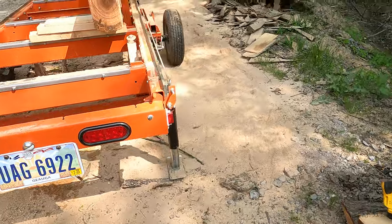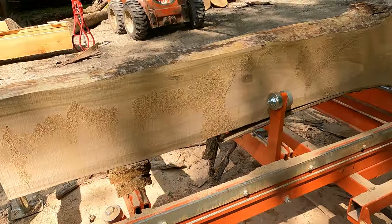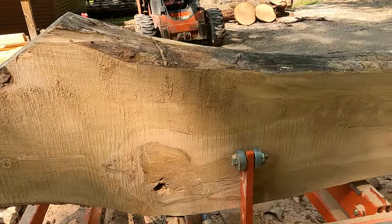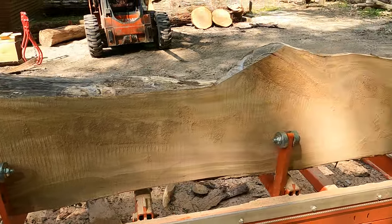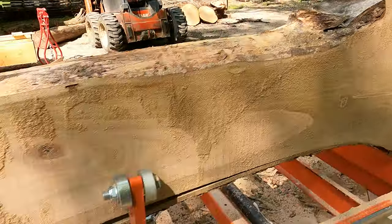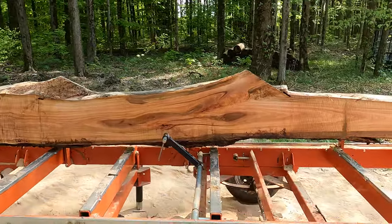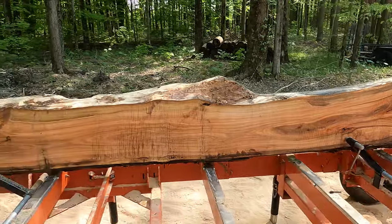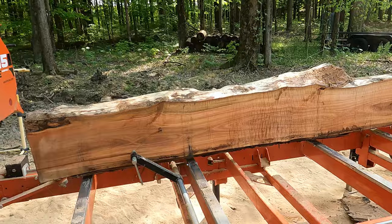So let me apologize for that. I don't know how much footage we just lost, but the GoPro locked up at some point there while I was filming. The picture was all purple. So this is this squirrely log stood up on end. I'll show you from the other side. It's easier to see. So you can see it's not really flat, but we're going to cut the top off and just try and get some 5-inch wide boards out of it. That's all I can do at this point.